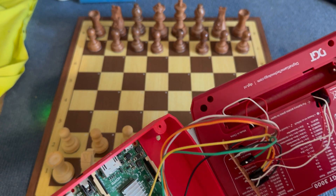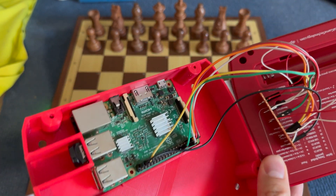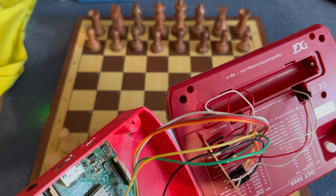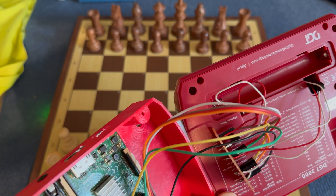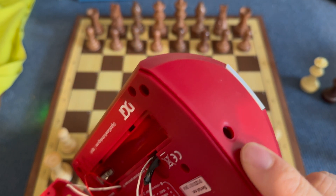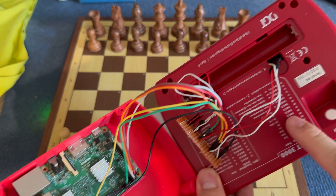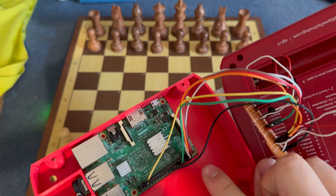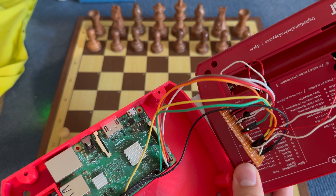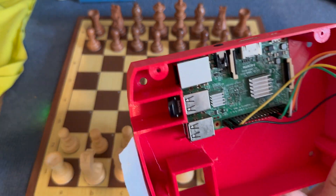You have the plus 3.3 volts and ground wire connecting directly to the Raspberry Pi, and three additional wires — one of those is ground as well, and the two others are I2C (I-squared-C). The original clock had a socket for a connection cable for DGT boards. You supply the DGT 3000 with 3.3 volts from the Raspberry Pi, and provide the SDA pin and SCL pin via GPIO connectors directly to the board.